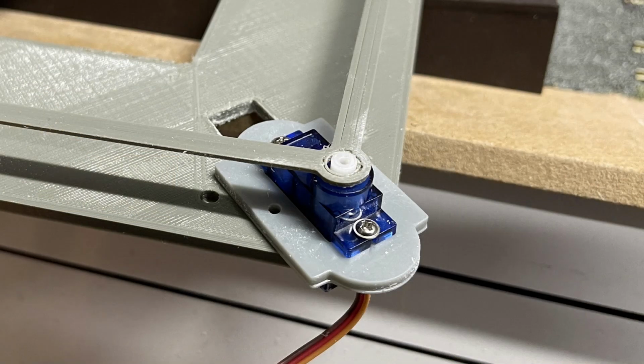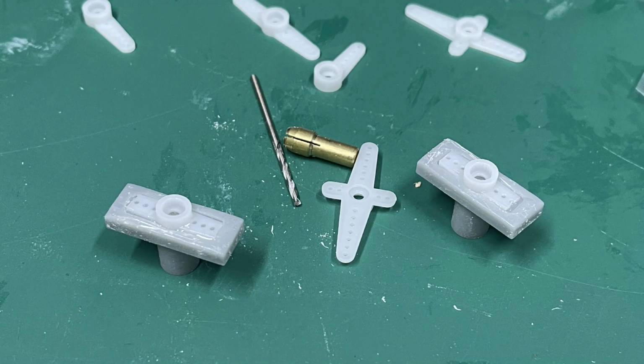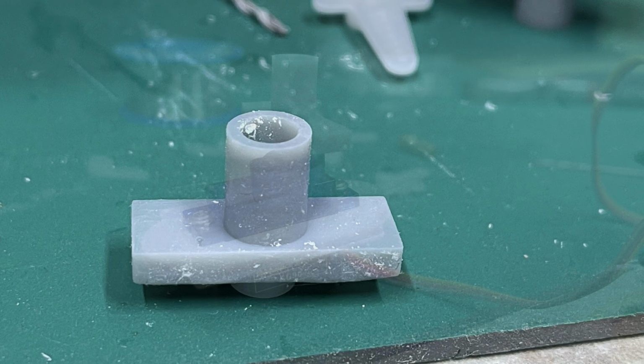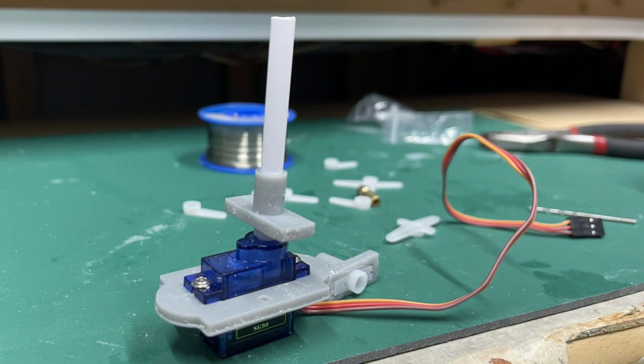The servo motors are adjustable in position to square off and make sure everything aligns properly. I then 3D printed some adapters which will take on the existing fitments for the servos, and then these can be screwed to the servo motors and then the posts inserted into the top, so the gate posts can fit onto the spindles as such.